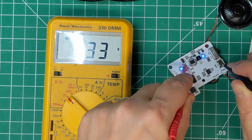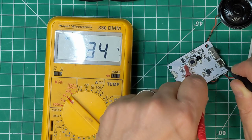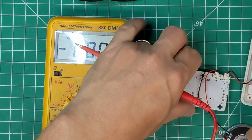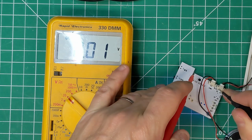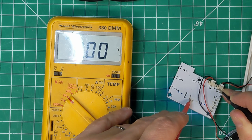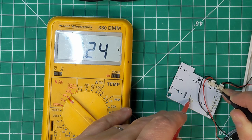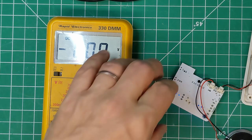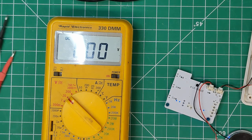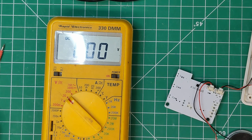Let's have a look with a multimeter at what's happening on the PIR pin. The ground pin is down here. When it triggers, it goes to 0 volts, and when it finishes it goes back to 3.3V — triggers back to 0 volts. So this pin basically goes to 0 volts when triggered, otherwise it sits at 3.3 volts. I can visualize that with an oscilloscope, even though most of you might not have one.